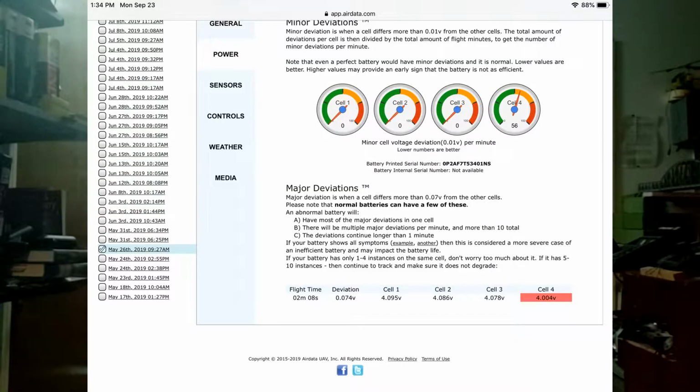it's something I'm going to be monitoring a lot more, because one of the things that I did was go back a couple months on my flights that I'd taken, and as far back as May, 2 of 3 of my Mavic batteries that failed were showing signs of failure even then. And by that I mean variances of voltage from cell to cell.